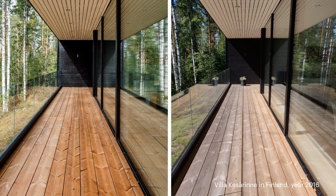With proper care and maintenance, you can extend the life of your Lunawood Thermowood decking and keep the decking in prime condition. The surface treatment of the terrace extends the life and improves the use of the terrace, so we always recommend the surface treatment. With brown pigmented oil, it is possible to preserve the brown tint of the wood. Otherwise, the thermowood decking will turn grey in time because of the UV light.